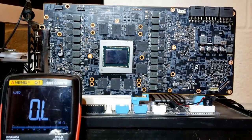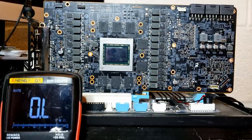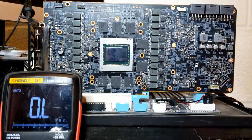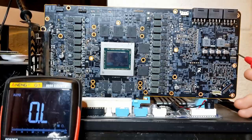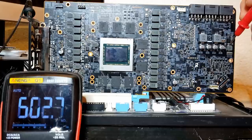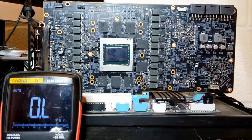When you have a short on 12 volts, it's usually not short to ground itself, but rather to ground through the GPU, in which case the GPU has been fed 12 volts and may be dead. But I don't think this is the case for this particular card. I should note I've never worked on an RX 6000 or 5000 series card, so I'll base my opinions on the RX 580s I've worked on. Starting with this inductor - it's 10 kilo ohms and rising, so we're going to ignore it. It's obviously not short.